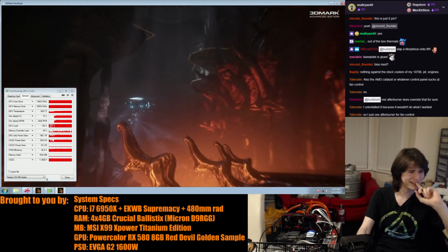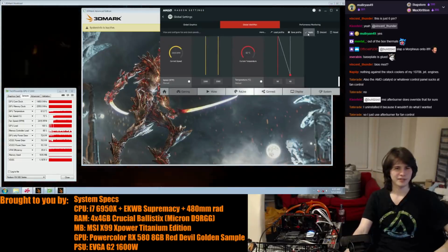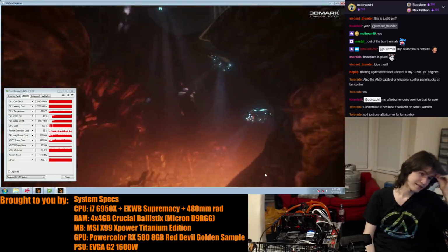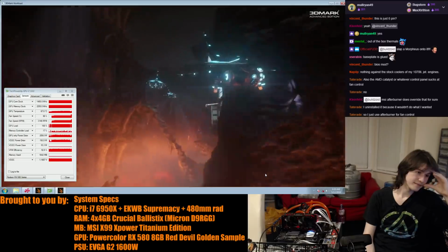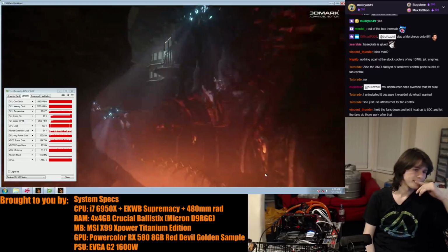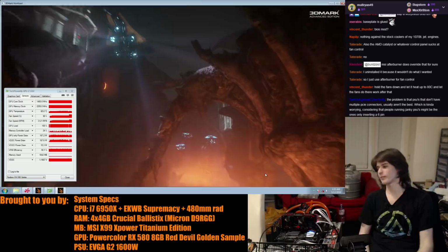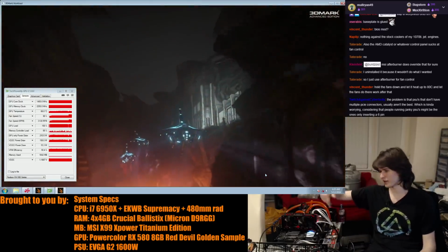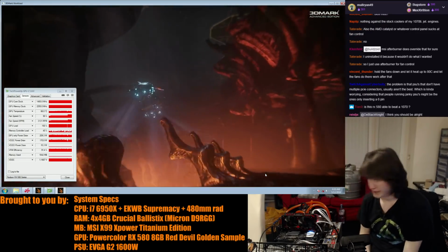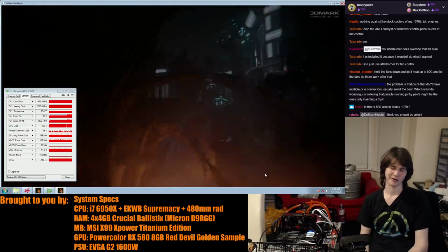That sucks. So, okay, wait, I'm going to crank up the fan speed again. Absolutely max it out. See if we can get it lower. You know what I really wish? That the card had a two-piece heatsink with a separate cooling plate for the VRM and the VRAM. Because then I could go and grab one of the Morpheus 2s and just slap that on there.